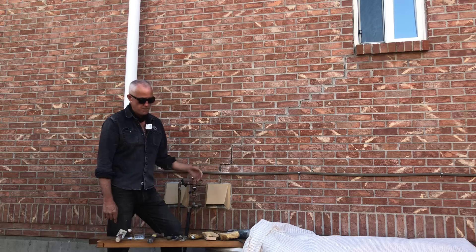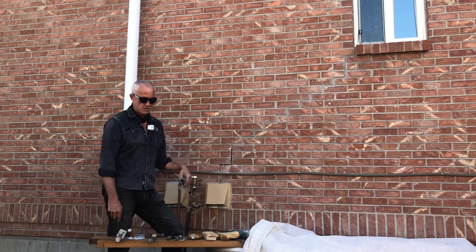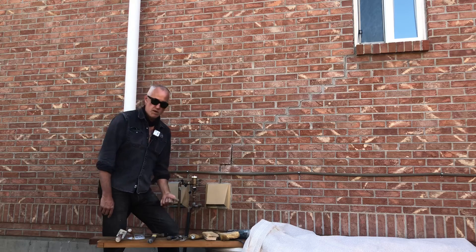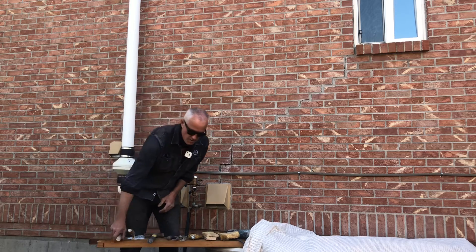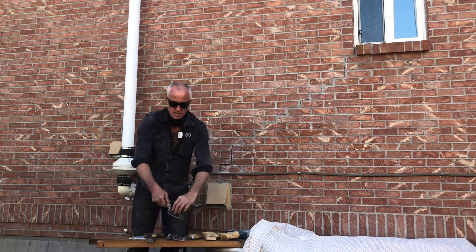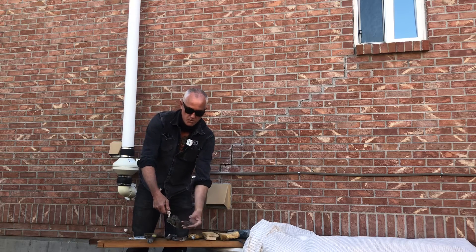You can get it pre-sanded. I don't like pre-sanded — I prefer to mix the sand and the cement myself, so that's what I've done. When I mixed it, I did not mix it like I was going to lay brick. I mixed the mortar so that it's pretty tough — it looks like moist soil.